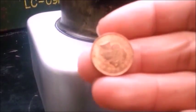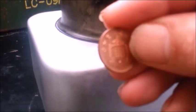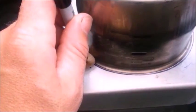Now to give this, say, 5mm lip, the overhang, what I've chosen to do is find something that's about a centimetre. This is a one penny piece UK, and I've cut around it using some thin card. Because this is a centimetre, half of it will be 5mm, and if I place that on there, put a pen in, I can draw around to get the overhang lip that I need. Push that against the edge and go round.